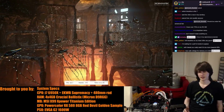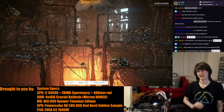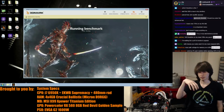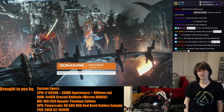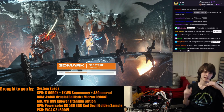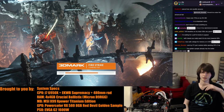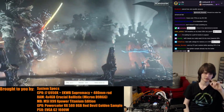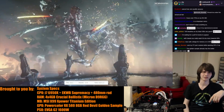And the other thing is, I can't find that voltage on the PCB either. I can't find the VRM that produces it. There's a good chance it's some kind of regulator built into the die of the GPU. And it still doesn't really do anything for overclocking, in my experience. So I don't mess with that voltage. I have heard that if you're undervolting, that voltage acts like a V-core floor, though. I'm not sure what's up with that. It does the same thing with Vega, where if you set your memory voltage really high, your core voltage won't go below that. Which seems to indicate that it's probably a built-in regulator on the die.